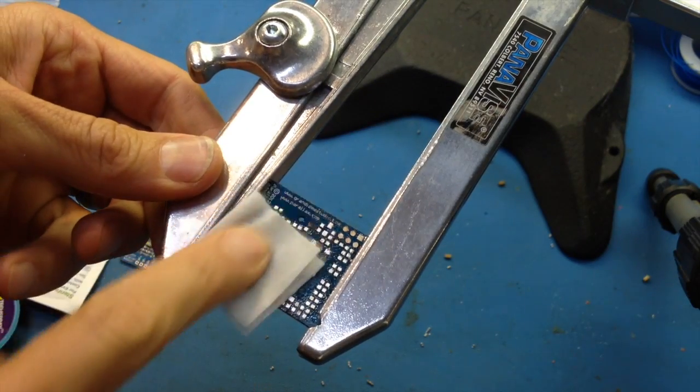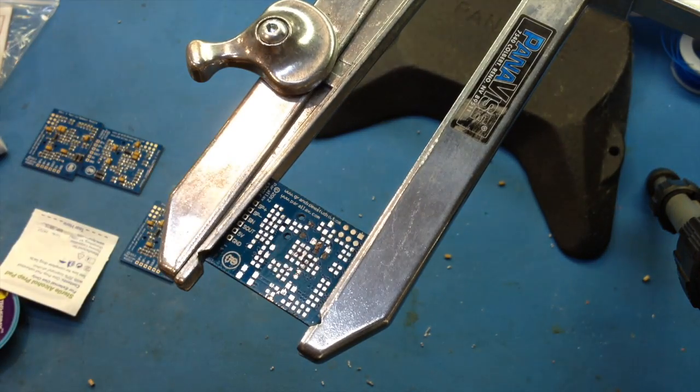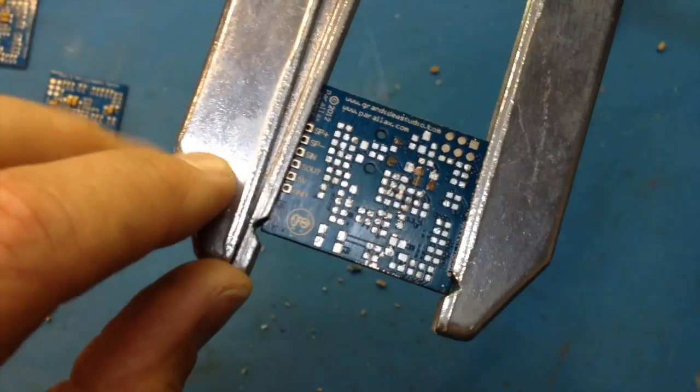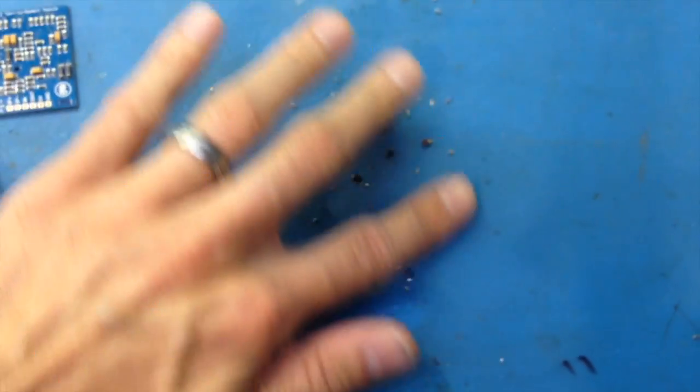A little alcohol pad, and there we go. Here's a close-up of the board. You can see some of the pads came off — I was probably a little bit too rough with the brass pad. Here's some of the components that came off. So there you go, the technique worked pretty well, good enough for my purposes anyway. Here's the final board, and thanks to John for the tip. Surface mount, brass pad, hot air gun removal technique — successful.